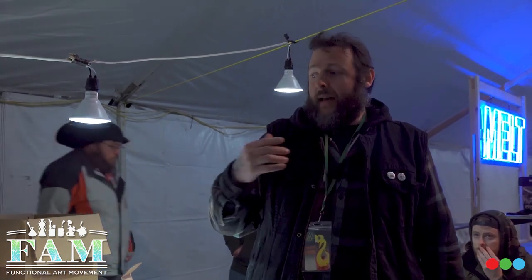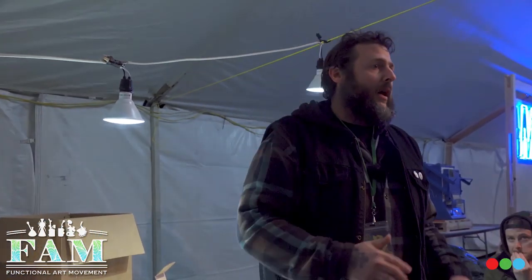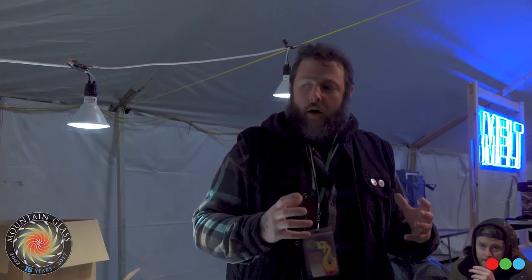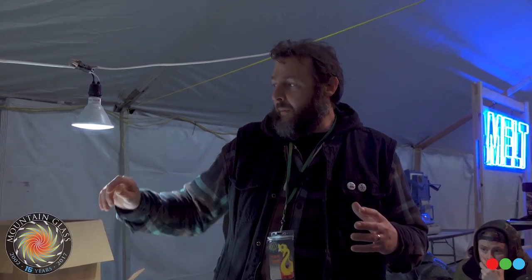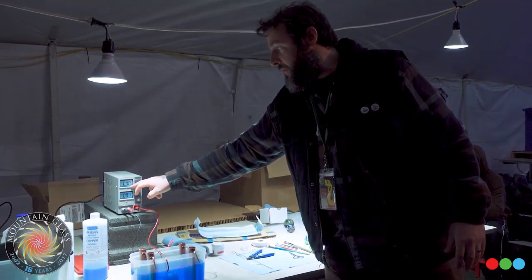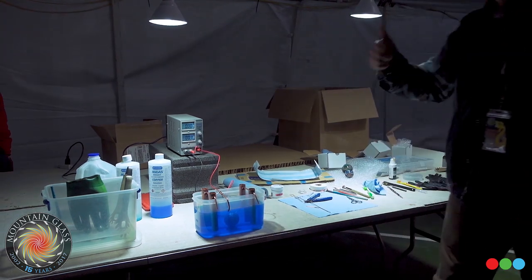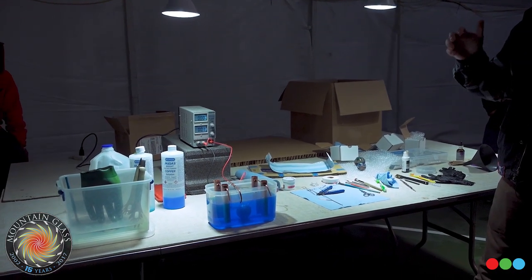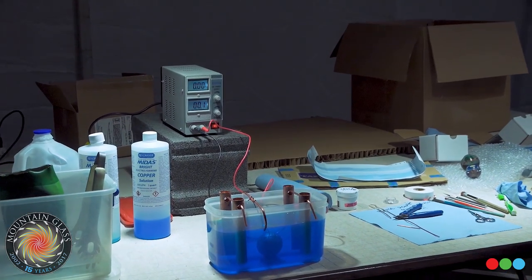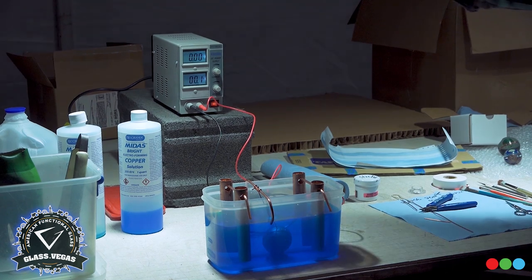So now the way I look at that 0.20 amps per square inch is as a guideline. If on the final day, when I have a lot of copper accumulated and I'm able to turn these amps up to 2.25, and this doesn't want to bounce up to 0.2 volts, that's telling me my solution is getting really dirty. That's telling me there's some resistance in there happening, because I never have to really push the ceiling of those rates.